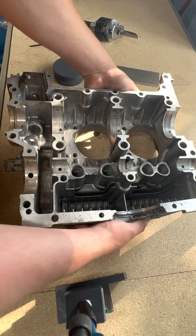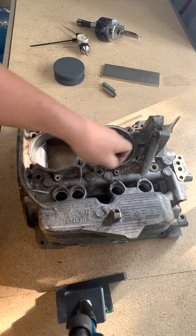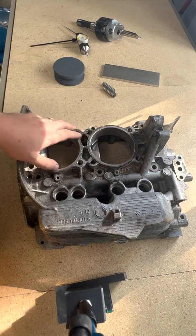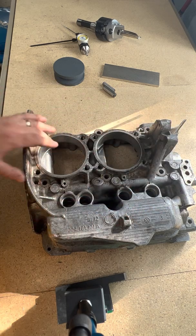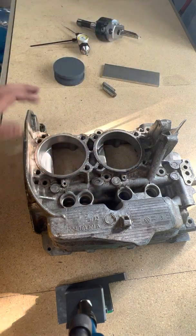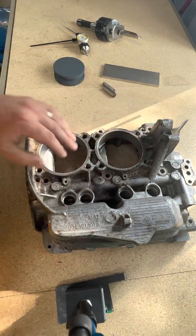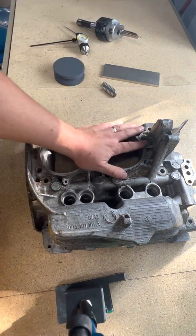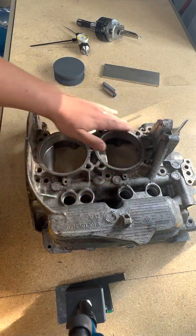So for all practical purposes, we're talking about boring holes. These right here have a quarter of a millimeter clearance on the cylinder — that's roughly ten thousandths of an inch. With four ten-thousandths flatness, we're more than good enough to just lay this down on the mill and bore straight down. If it was really out of whack, you might want to shim it up on one side or the other to get down to the centerline of the crank. If you're over a thousandth of an inch off, I'd start thinking about it; at two thousandths, I would definitely shim it.